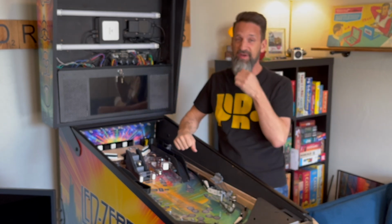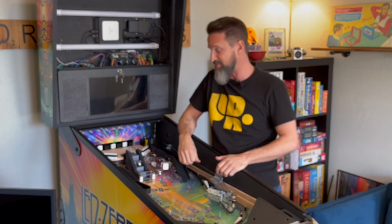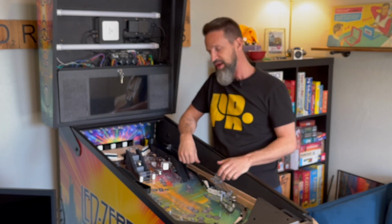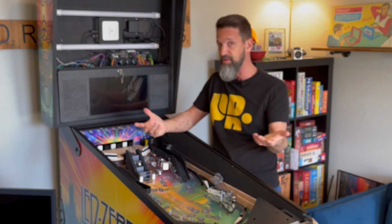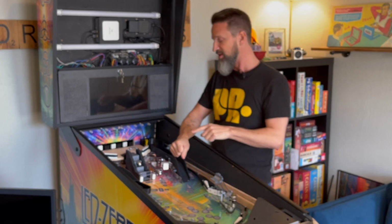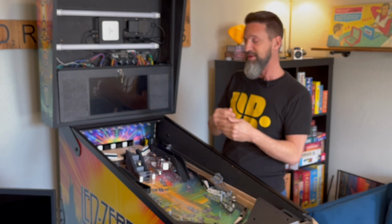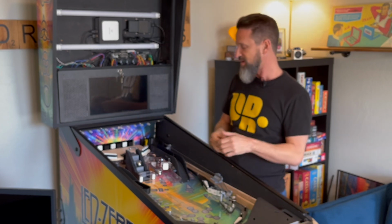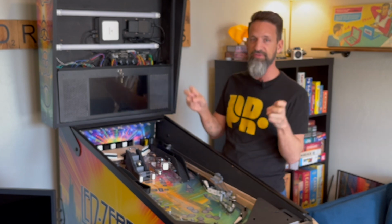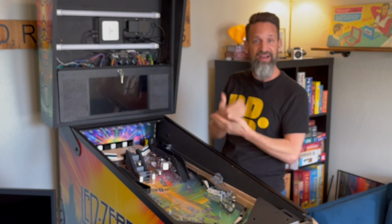There's been a number of other things we've run into as I've been experimenting that, bless his heart, Anthony's been very quick to say, oh, we can add that feature. We can add that feature. And he's been amazing to add it in, and now it's available for everyone. So he did exactly that. Not only do we have the ability now to control a stepper motor in relative increments, versus just absolute positions, you also now have the ability to trigger a home sequence where it'll tell the stepper motor, move until your homing switch is active again.